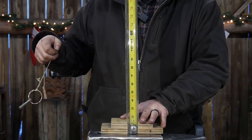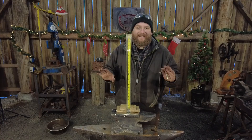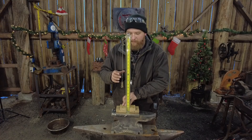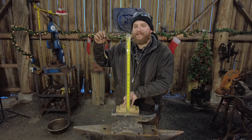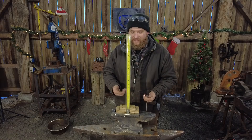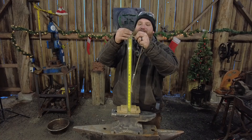That has not happened on any of the Harbor Freight anvils that I've tested so far with any of the methods I've used to try to make a better anvil out of them - that reoccurring, not only the initial bounce height but the reoccurring bounce height. We are clearing nearly 15 inches depending on the bounce, so about a 15 inch return on a two foot pipe from this Harbor Freight anvil. I would say that is definitely hard enough. It's got a pretty good return to it.